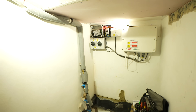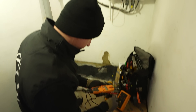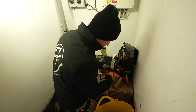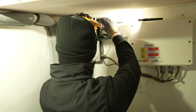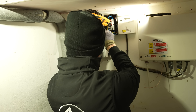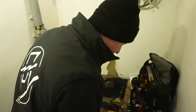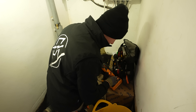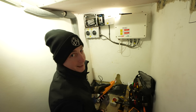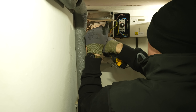With my trusty voltage indicator - let's prove this properly. We've got voltage. Live to neutral: nothing. Live to earth: nothing. Neutral to earth: nothing. And we prove one more time - still good. Yeah baby, now I can stick my hands in there. Working four meters above Chester's head was me, all the way up on the roof.